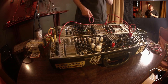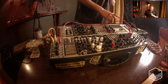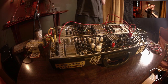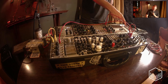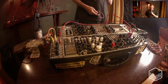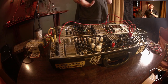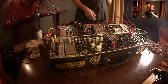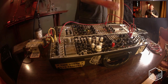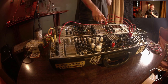What we do have is a sequencer, which we can use, which is this little guy over here. As it's running, I don't know if you can see from there with the light and everything, but this is just running a loop of 8 steps. So it's cycling through 8 individual notes almost. And we can tell it on some notes to output this little blip of electricity, which is known as a gate signal. Same thing that happens when you press a key. And it will run this automatically. So that's coming out, and our little gate signal goes into the handily named gate input on the envelope.